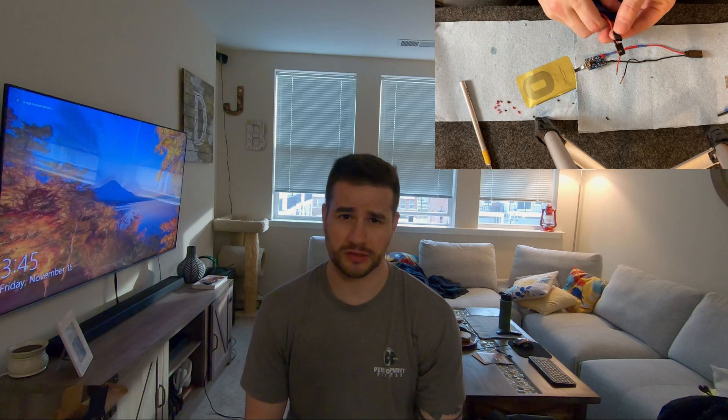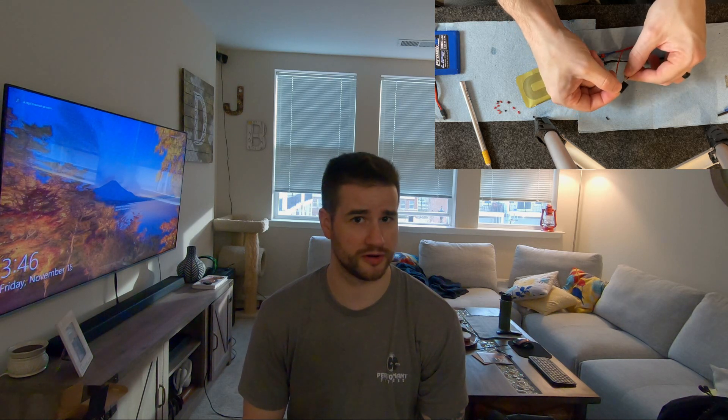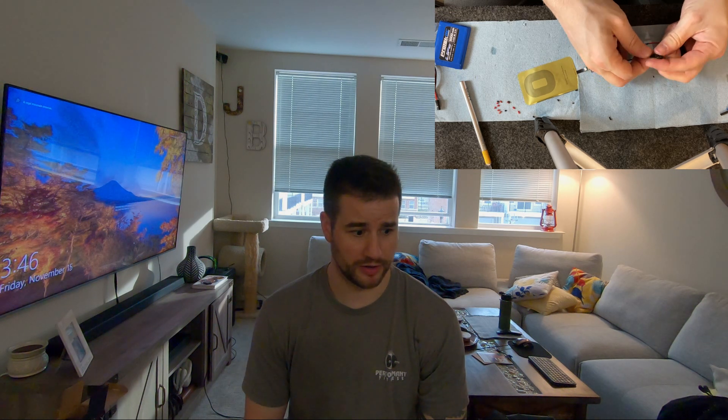There is a cutoff voltage of 4.2 volts on that circuit itself. I didn't think I'd reach the cutoff voltage, but it appears to be working great. I tested the radio again today — there is a slight current draw for this circuit board, but it's really minuscule. My radio is still sitting at 4.1 volts. This is awesome. I no longer have to take my LiPo battery out, put it in my charger, set up the whole program, and trickle charge it, which takes forever. I'm happy with how this turned out. We'll see in the long run if it holds up, but for now it's looking pretty promising. Thanks for watching — if you guys have any questions, please let me know.